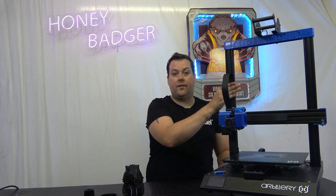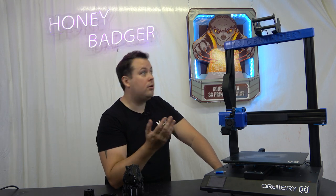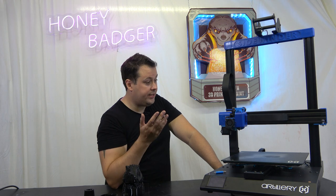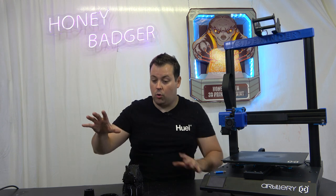There are people who don't like flat ribbon cables — that's fine, but these work, and they've all been reinforced. There are people who don't like the plastic X-beam, but it makes no material difference to print quality. I honestly can't fault the machine. The only reason it's getting a 9 is that we printed everything at around 75mm/s, which is really getting towards the limitation of a regular Cartesian. It's not a Delta or a CoreXY with extra frame bracing. 75mm/s is acceptable for good quality prints, but I've tasted what the Voron 2.4 can do and that's my benchmark to beat right now.